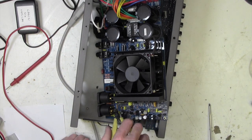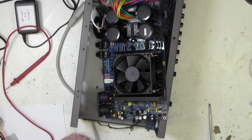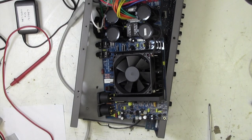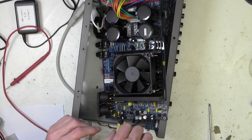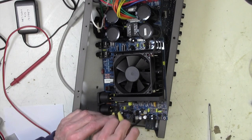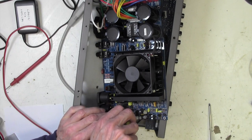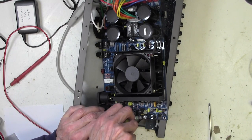Now, it's not going to help us terribly. It's much easier if you can just cut these out and then desolder each pin at a time rather than trying to get a complete clean desolder on 2, 4, 6, 8, 10, 15 pins or whatever so that you can just lift the chip out. Very hard to do that. So I think we can just cut these like so.